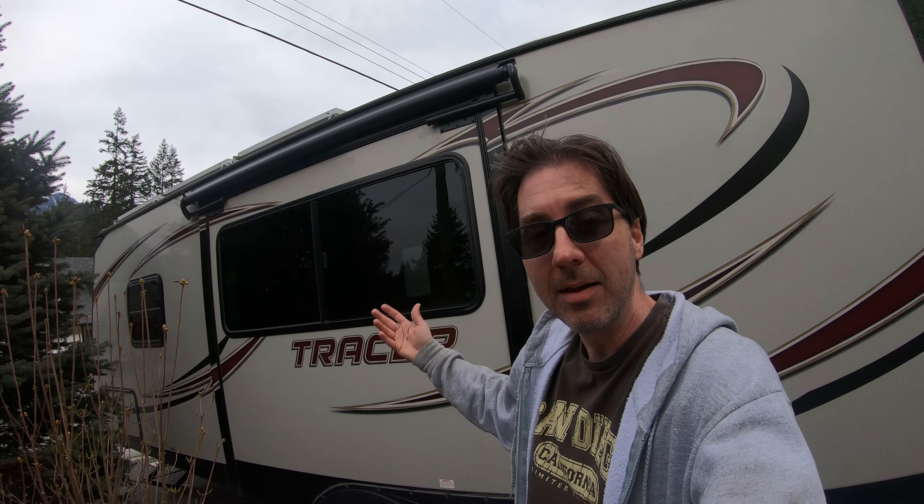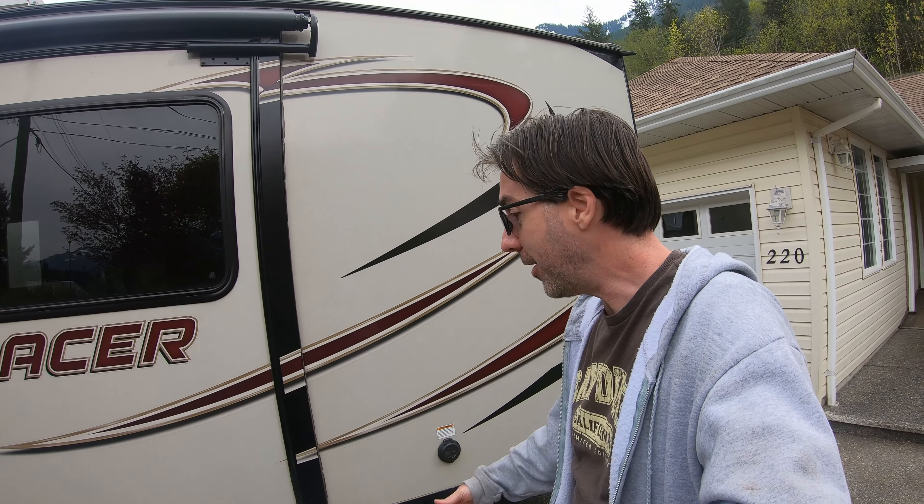I've seen a lot of online debate about whether tilting the panels is actually worth it. Right now it's about mid-April in southern British Columbia, Canada, and the sun is about 45 degrees. If I tilt the panels 45 degrees towards the sun, I actually double the output — so I think it is worth it to have your panels tiltable if you can. One really cool thing about having the solar is we don't have to plug the trailer in anymore. Before, we had to plug in just to keep our battery topped up all the time, but now it tops itself up from the sun. And we don't have a cord running through here now, so that's an added benefit I didn't even think about.